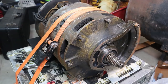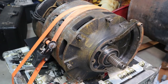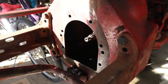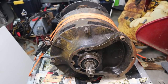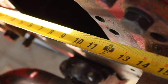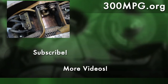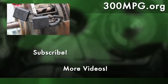One caveat — this motor might actually be too big. Looking at the front of the transmission on the farm tractor, there's not a tremendous amount of space between the side rails. The motor is about twelve and a half inches in diameter, and some of these spaces are only 13 inches wide, with less than six inches to the bottom. To find out if it will actually fit I'll just have to try it — get it up on an engine hoist and see. If you want to see that, make sure you subscribe.